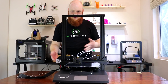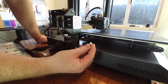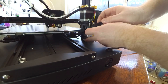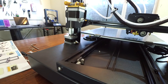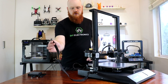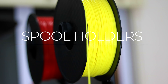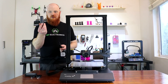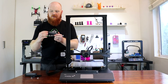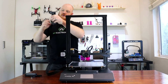Now we're ready to plug in the motors. On the left side of the printer there's a little hole and a wire comes out with three wires inside — just take that and put it into the little plug here. Still on the left side, take this wire and push it into the motor there. Then do exactly the same thing on the right side. After plugging in the motor wires, attach the ribbon cable — it goes in here, with little tabs you pull out before the cable clicks in. Then take the little pop, put it through the hole, screw in both rings on each side, and put the V-slot nuts and screws in to secure it.